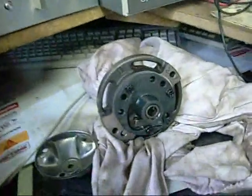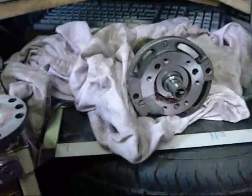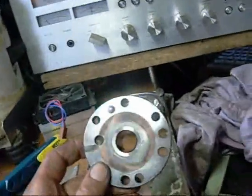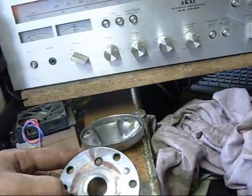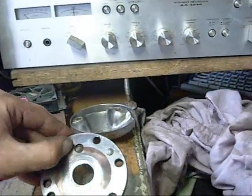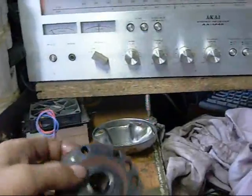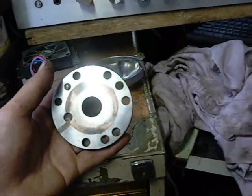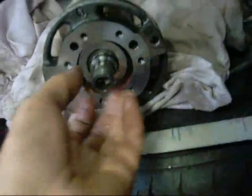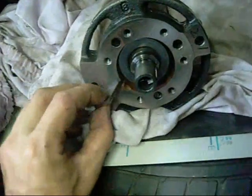So I always wear eye protection, especially when working on one of these - you know you get shot in the eye by a load of refrigerant and oil, and it's nasty. It's definitely showing some wear. I believe these are hard chromed, and under that hard chrome is always a layer of copper electroplating, and you can see it clearly showing through there - there's almost a step worn in it. So it wouldn't just be the vane; I think this thing's just been worked hard the last 10 years or so. Particularly since Brad got it - he'd leave air conditioners running all day and all night to the point where ice crystals come flying out of them. He was actually awoken by the sound of chunks of ice breaking off the inside of the evaporator coil and getting chewed up by the blower and spat out of the vent. That's how long this thing ran one night.